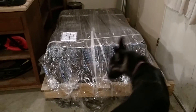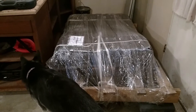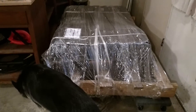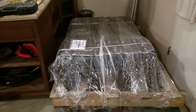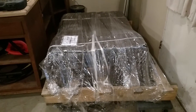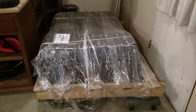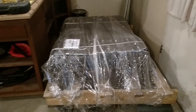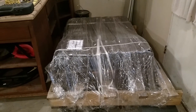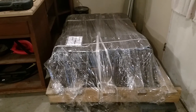We're going to do pretty extensive videos of tearing this thing apart and breaking it up. I'm going to try to get the BMS system back up and running on it. I was looking online at some of the boards, and it looks like it's actually serial communication, so we should be able to get that — I don't think we even need to do CAN bus. We'll probably try charging it and try to get its internal contactors to click in to see if I can actually read it. Might do that before opening it.